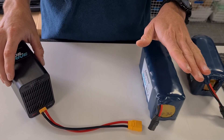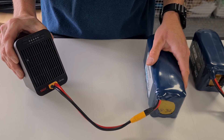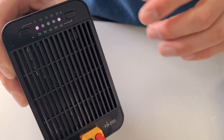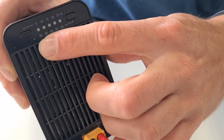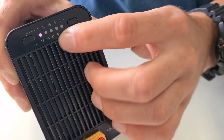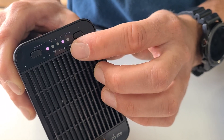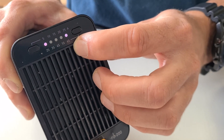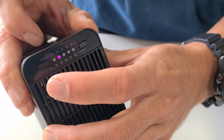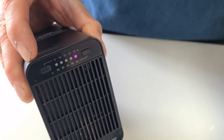It's all the same because it's to do with the voltage of the batteries. The main setting we need to make sure is correct — pretty simple. Plug it in, nothing happens when you first plug it in. You can press either of these two buttons and it initializes the system. The right-hand button has lines going down to two, three, four, five, or six S. The Assist Plus batteries are an eight S battery, so two and six is eight S — two white lights. This button has the line going up to five, ten, fifteen, twenty, twenty-five amps — that's how many amps it's going to discharge your system. Twenty-five amps is totally fine for these batteries and it's the fastest way to discharge it.